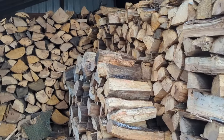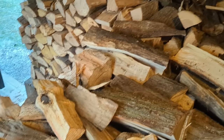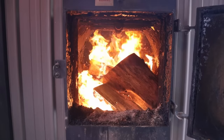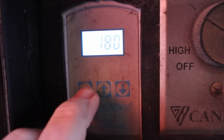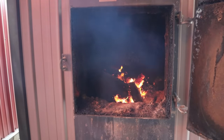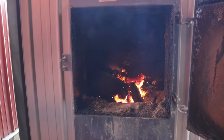The third reason for cutting some of this firewood down into smaller pieces is that the fire burns more efficiently with different sized pieces in there. If you throw in only big huge chunks of wood, then they will burn a long time, but they won't allow the stove to recover quickly when there's a large temperature draw from the water. During the coldest months I set the desired water temperature to 180 degrees, and when that temperature is reached, the stove shuts down the fans blowing on the fire and therefore removes most of the air required for combustion. The fire will then begin to smolder. Large dense pieces of wood will therefore remain mostly unburnt right after they've been thrown in and for quite a few cycles beyond that.